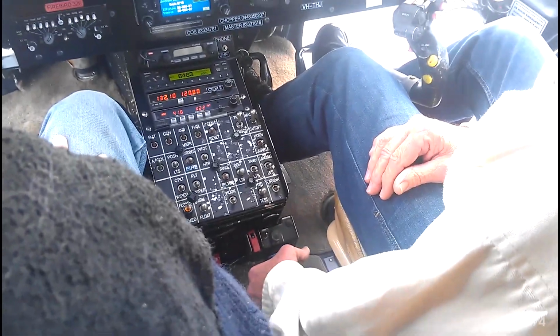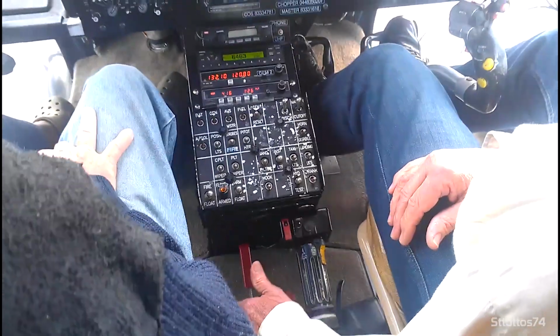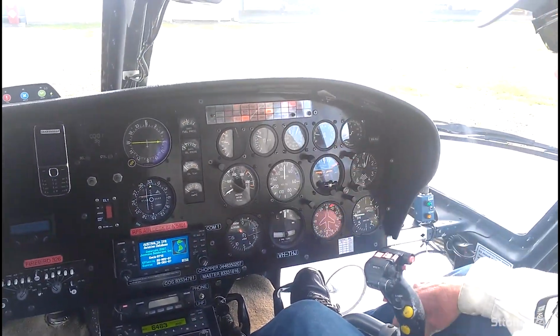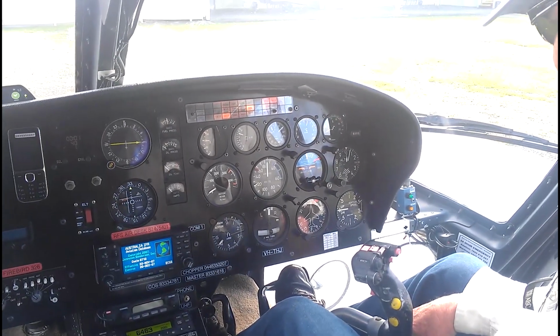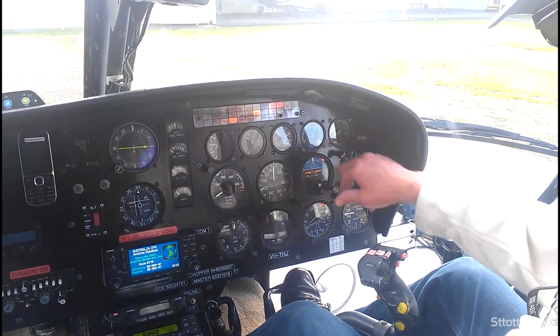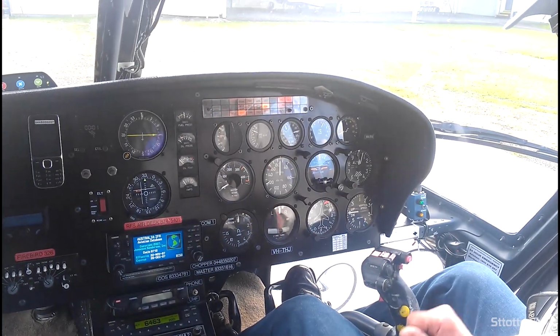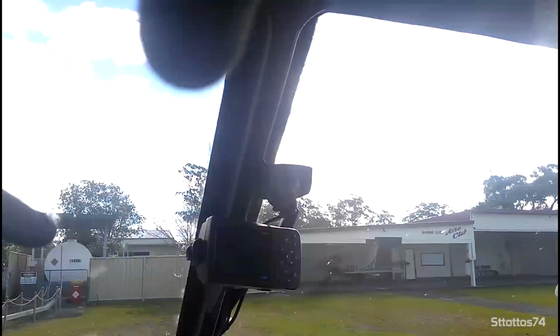What I want to do is go back to, that's the stop for flight, for ground idle there. So I just go after that a little bit, put that down, and now the solenoid is okay. And we'll light it off. There it is, it's lit off. Monitor the temperature. I stay below 700. Blades turning, oil pressure's coming up. But I keep the starter engaged until 40.